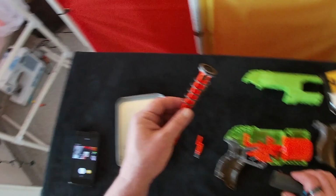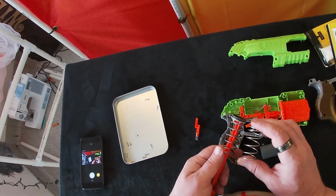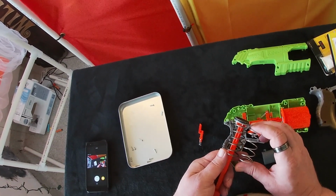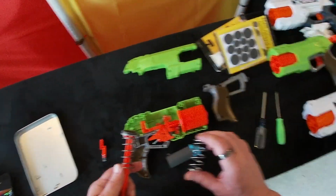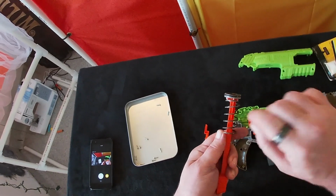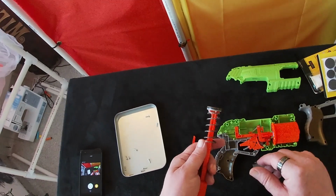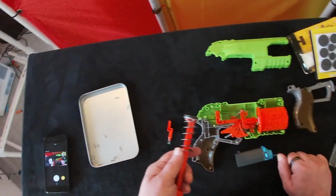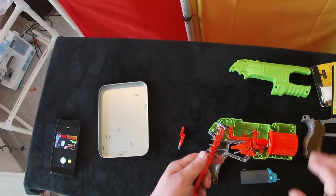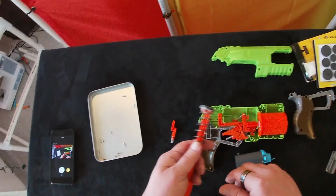There's the spring, there's the chunk of K25 on there. This is the original spring, and what I did was I cut the chunk of K25 to be exactly the length of the original spring. And then I kind of squared the ends down just a little bit, bent them down with a pair of pliers. So just a little bit flatter, a little less stress there, a little easier for it to just drop right in there, and fit in with just a tiny bit of pre-compression, so that's nice. So you don't get any spring rattle. You don't want to do that too much so it's loose in there and rattling around.